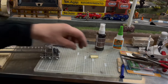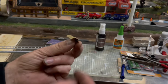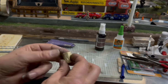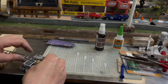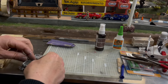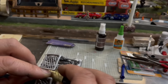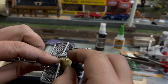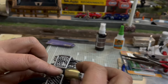And what I've done is I've made a little finish plate, okay? So it's all rounded out. So just split it and then widen it out. So you kind of bring it like so. And then what this is going to do is this is going to fit right down inside here. Let me just go ahead and fish it down over the top. We can glue that into place and it works as a finishing plate that covers our wires the rest of the way. So what I'm going to do is go ahead and get this glued in, and I'm going to paint this ahead of time.